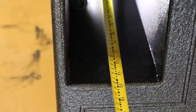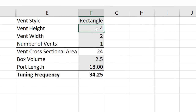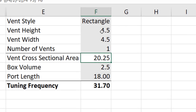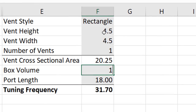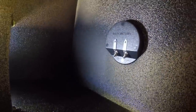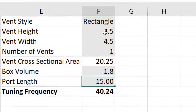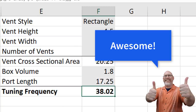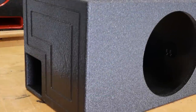The length of the vent seems to be about 15 inches. I make port calculations quite a bit so I just stuck them in a spreadsheet on my computer — I make this file available to my patrons on Patreon. We plug everything in and get the port length, and we see it's probably tuned closer to 40 hertz. But you have to make a little correction because that port is going to load off the sides of the enclosure, so we add a little bit to the port length.